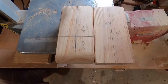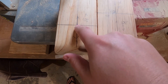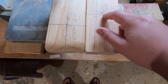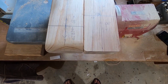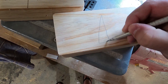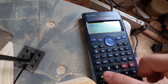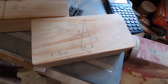To this edge it will be 68.2 millimeters, and on the bottom block it'll be 68 millimeters from the front end. I've marked them here - this is where the mast is going to go through on the upper block, and this is where it goes through on the lower block. Over the height of the mast trunk, that distance should give us two and a half degrees.